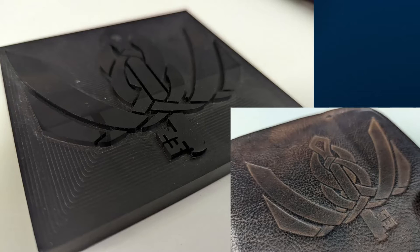This is another stamp — specifically a leather stamp, a cold stamp. This material is acetal, also known as Delrin. Delrin is a fantastic material to machine. It's relatively inexpensive and holds great detail. You can see, especially in the lower left-hand corner, the path that the cutter took in order to cut this part. And on the lower right-hand side, you can actually see what it looks like after it was stamped into leather.